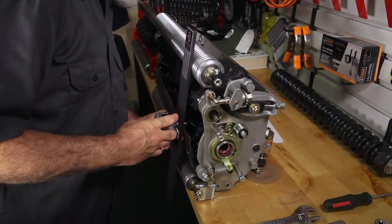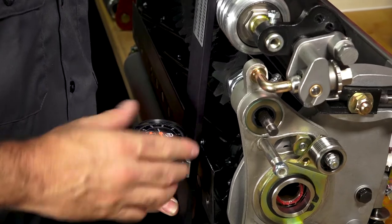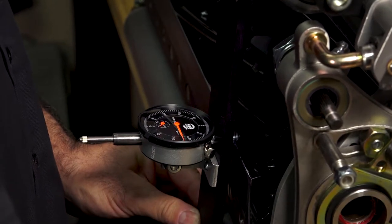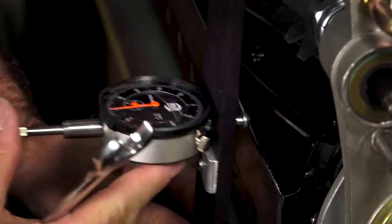To use the Master's Gauge, simply place the bar on the front and rear rollers, then place the measuring rod until it sits on the front edge of the bed knife, keeping it in place. Once in position, adjust the rollers until you reach your desired height of cut, and then repeat on the opposite side.